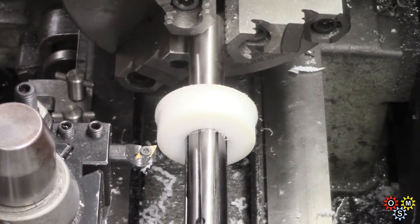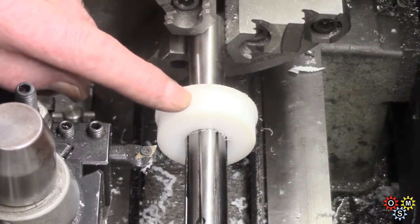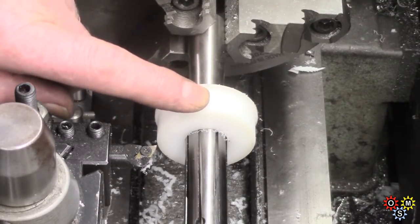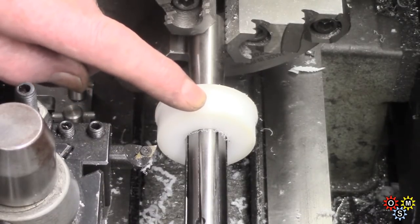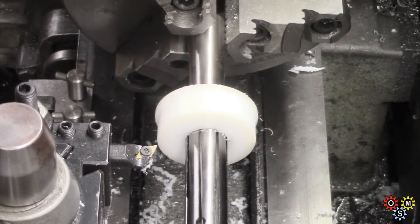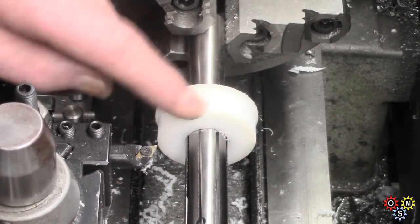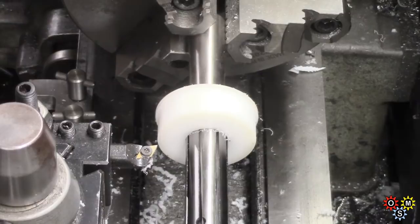Anyway, desperation measure, yeah. I wouldn't say it was quite a bozo, but I did a calculation originally on the idea of the tube. And as I said, it was out of round. And I took it down to, I can't remember what it was now, but it was still a bit too large. So I did a calculation, which I should have done originally. The tube is 50 mil, which is 1.968. Wall thickness .040, so subtracted .080 and comes out to 1.888. So I'm just taking this down fractionally. I may even have to use the press to get the damn thing in if I can't whack it in.